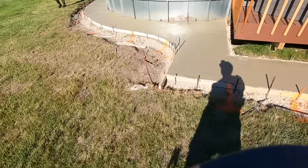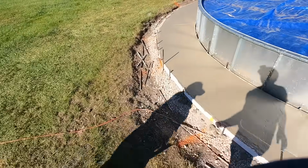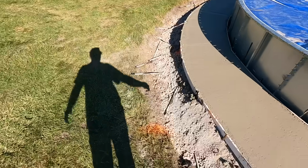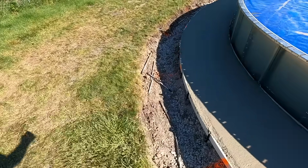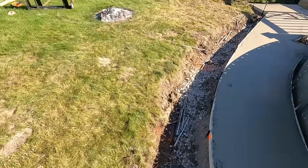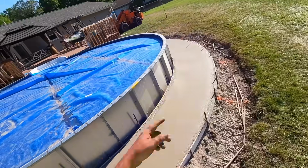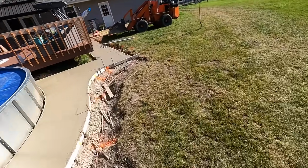All right, concrete's just about all down. Just got a little area to fill in. Grab a little extra, I'll dump some around the edges here. We can use a little extra on the edges for finishing. Truck's washing up. We're feeling good on time. Oh, we got plenty of time yet, so that's good. Probably start tooling joints and let those guys start edging, and then I'll tool joints in behind them, and then we'll finish later on.